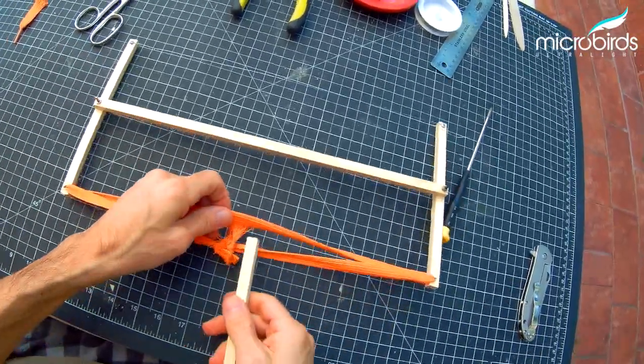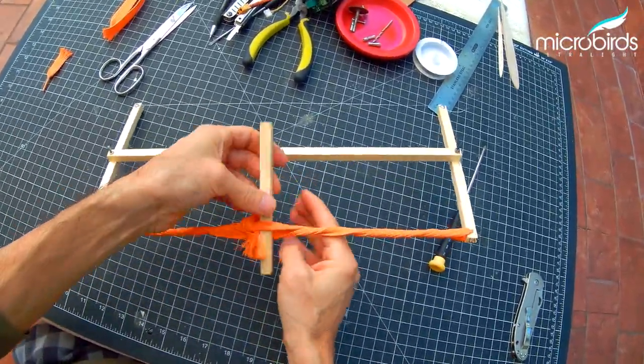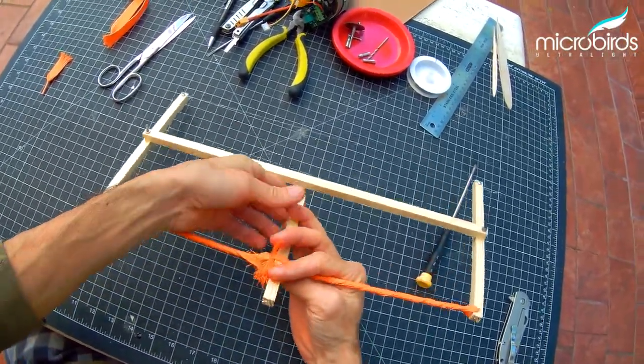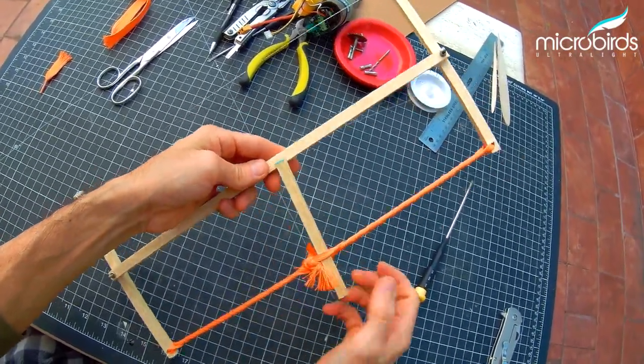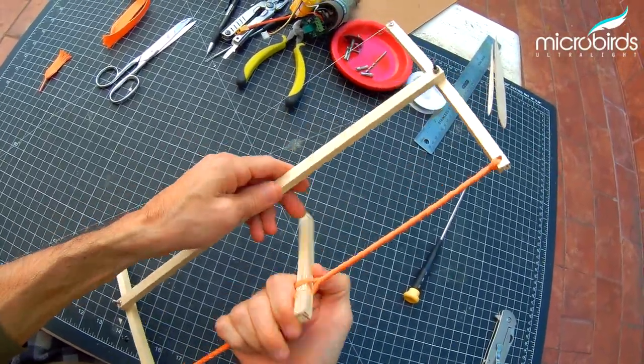Wind the shoelace with a piece of stick until it's nice and taut. Count the turns. If the wire snaps, you know next time not to exceed that number. The worst that will happen is you will have to replace the nichrome wire, which is not a problem.